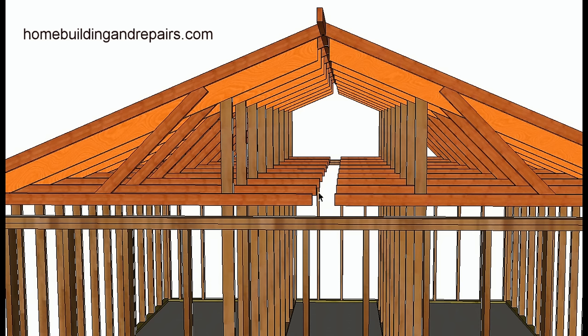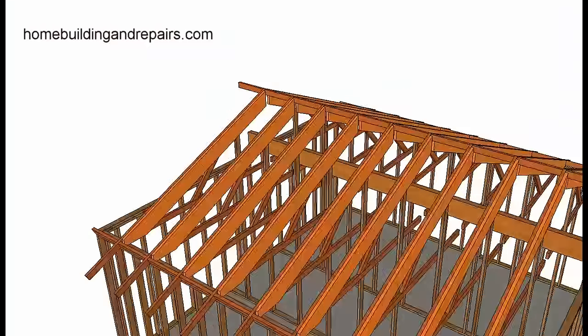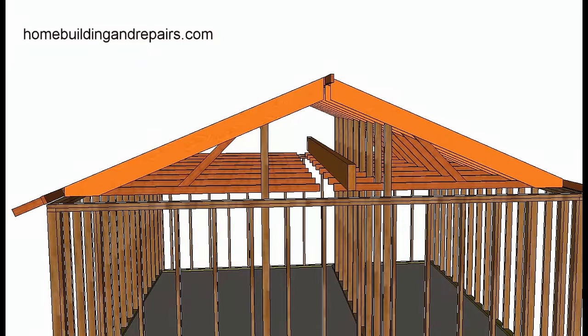Next, you'll need to cut a section out. The reason I removed the center is because normally we have truss clips sticking up. You can cut a section here and then cut the braces if you have any. You might have a truss that just has one 2x4 coming down — cut it and remove the 2x4 and you're good. You can put the cut anywhere that's easier for you to get the beam in. The reason we're cutting this out is to slide the beam into the attic area. You will need to cut a space somewhere unless you have another access — like an open side of the building — where you can just slide the beam in without removing anything.